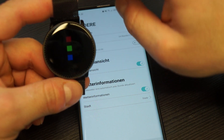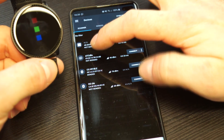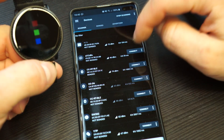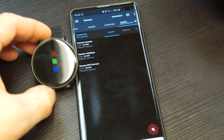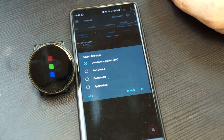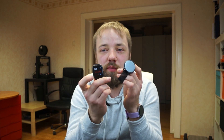Here you can see: red is the erasing and blue is the writing of the new bootloader. After that it reboots and these three colors show it's now in the real bootloader mode. You can also see it's the same MAC address as before. If I now connect to it, it has the Nordic bootloader on it and I can update it with any firmware I want, including the soft device or bootloader. That's it — if you want to know more, please write in the comments. Have a great day!